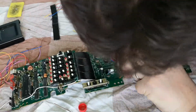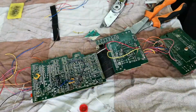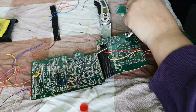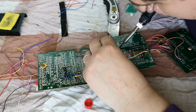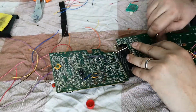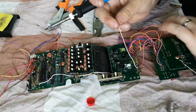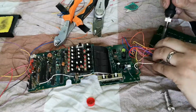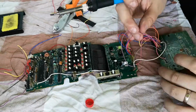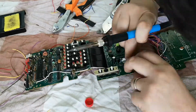Now, one thing that I did discover, and this is something that always annoys me about soldering, is the soldering iron tip gets oxidised very quickly. So it's almost a constant battle of using some sandpaper to keep the tip clean, and also that little wet pad as well, just to clean the tip of the soldering iron to get rid of any residue that may be on there. You also see I've got a craft knife in the picture there, and what I use that for is to cut away some of the ends of those little cables.